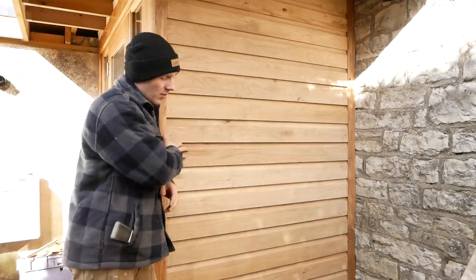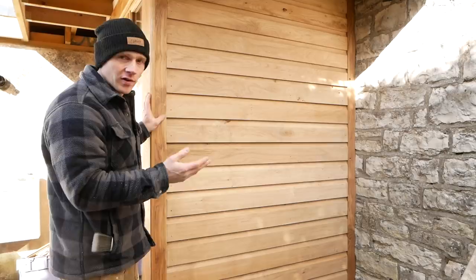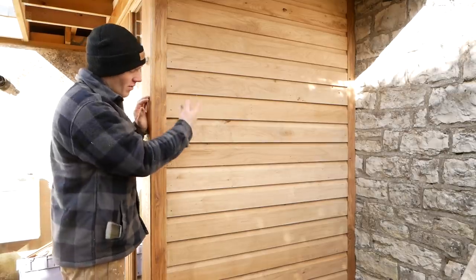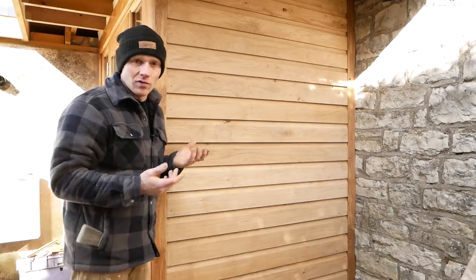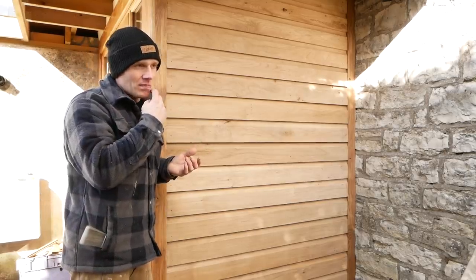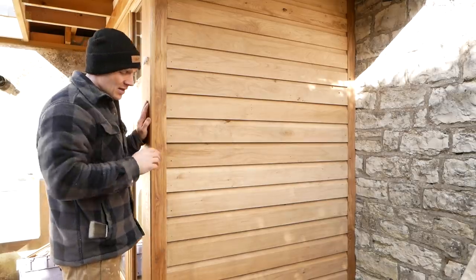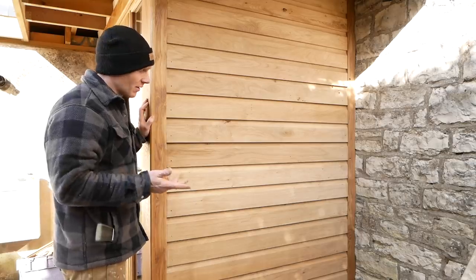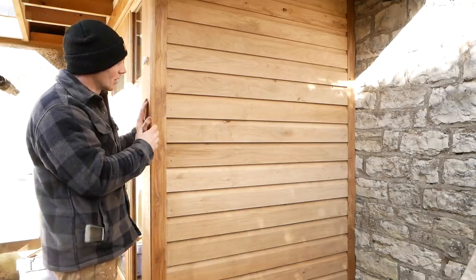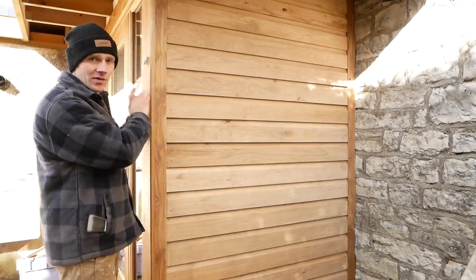That's another reason why I went with the oak. If I was letting this grey, then I would have probably gone for larch or cedar or something. And grey oak and grey larch is not a million miles off. Even pressure treated timber greys quite well. So that would have been cheaper and it would have blended in. Because I want to go this colour, putting the same finish on any of those softwoods, it just wasn't coming out anywhere near the same look. So I'm hoping when we get the finish on here, it's going to be somewhere near this one.